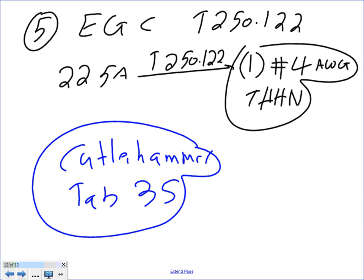Any questions? What I'm going to do for the rest of the day, guys, I'm going to be swinging around and help you place power. You should be able to place your receptacles, no problem. Your panels, no problem. The only thing I would like to help you with, if you need help, is the bus duct. There will be two bus ducts placed. Place the bus ducts with the disconnect next to the bus ducts. Assign a voltage and a volt-amp for the bus duct. For the disconnect, circuit the disconnect to the bus ducts. That's what I would like to show you.